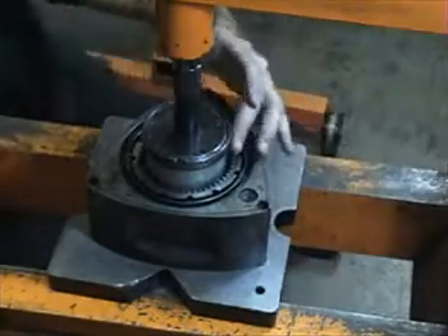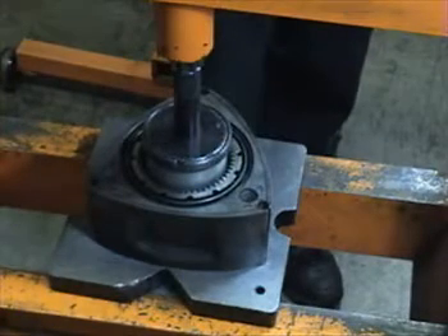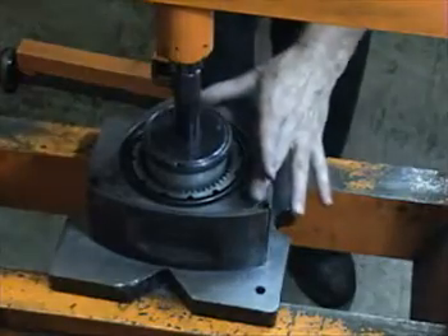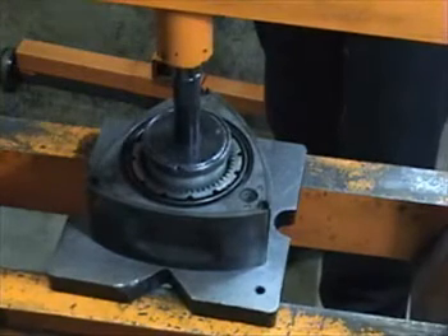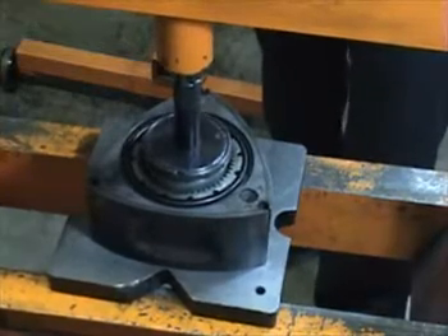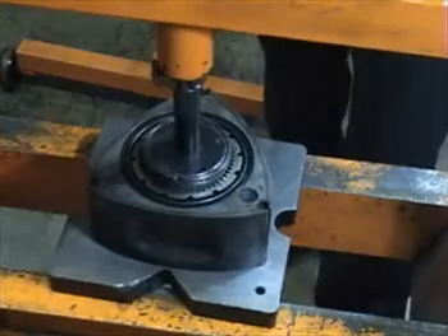We're checking to make sure in two directions, 90 degrees apart, that it looks level and flat. Put it in by hand — a little bit of movement at the beginning like that is very normal. Once you've got it in by hand slightly, release the pressure. Let your press settle and zero itself, and then we will continue to use that process of five strokes in, release the tension, until the bearing is all the way in. This helps ensure that any binding in your press does not end up pushing the bearing sideways and distorting it.